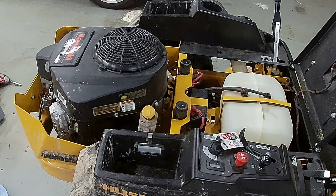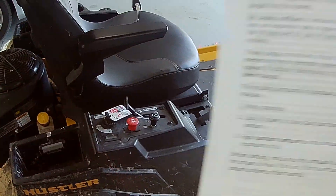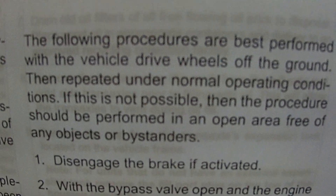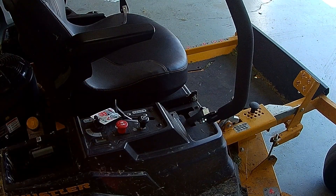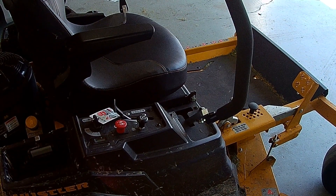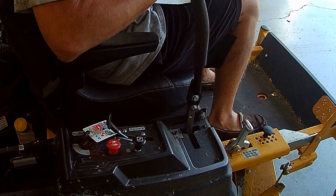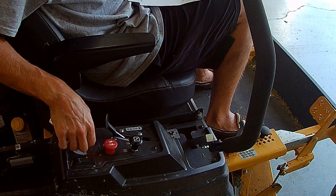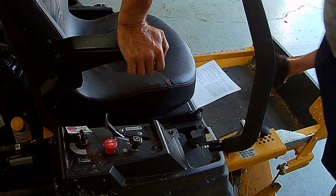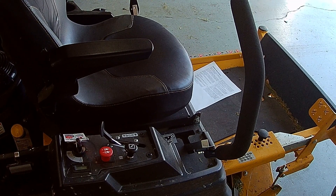We'll move to the other side now. This is what we followed to do this process — it's available on the manufacturer's website. For the purge: disengage the brake, lift the mower off the ground, then drop it back down, pull out the side plugs and top plugs, and top the oil off because it should have taken a little bit in.